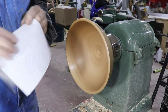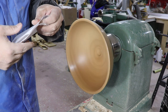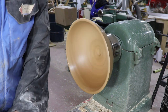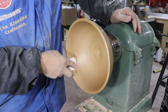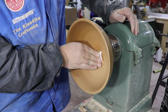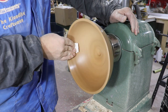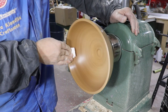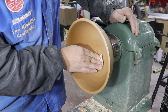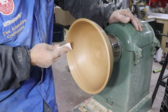Just sand it up really quickly, and the trick to sanding more quickly is to take the coarsest grit that you're going to start with and get everything out with that grit, so that all the subsequent grits that you use, all the finer grits, all they're doing is taking out the lines from the previous grit. They're not taking out any tear out or tool marks. Get everything on that very first grit, and then go through, and don't skip grits on the way up to wherever you're going to get to, but it really goes fast if you do all the work with that first one, the most coarse grit. There's a ton of videos out there on sanding and how you should do it.